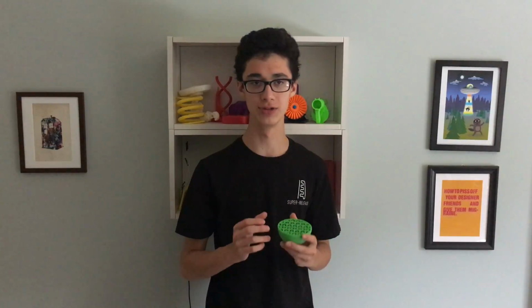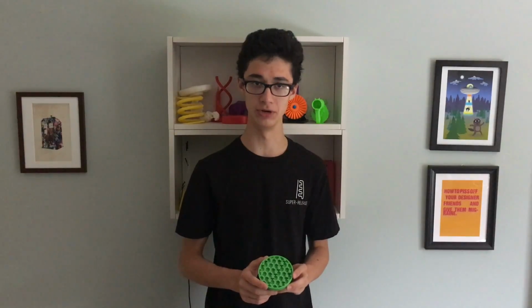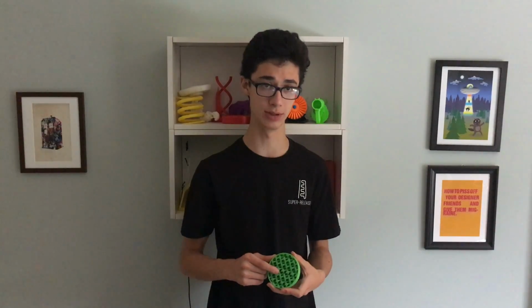And so to solve that issue, I think I'm going to decrease the density of the cells to 15 millimeters. On the last one, I had them at 10 millimeters. So this one's gonna be 150%. I'm worried that with that, the individual tubes making up the cells are gonna be much longer, and because they're quite thin, they could either fall down or wouldn't transfer force well. So I'm gonna increase the diameter of those tubes to 4 millimeters.